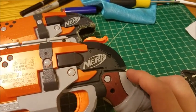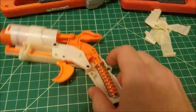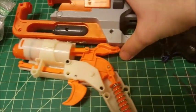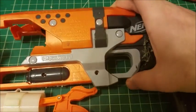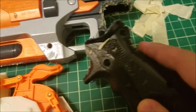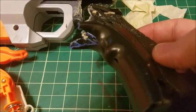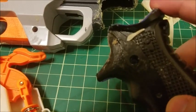Now, as a downside, you do lose all of the screws here, and you lose all of the locating pins here and here. That is acceptable losses. I think that you can recover from that pretty easily, and then it will accept this rough cut handle that has been cut down. I made a little bit too much of a judicious cut there, and then in sanding I accidentally buzzed down a bit on the inside. Whoops! I can repair all of that with epoxy putty without any real issue.